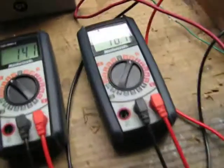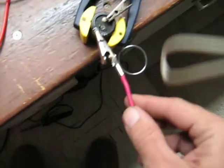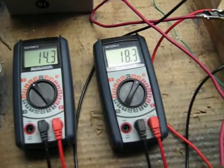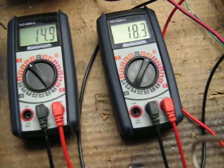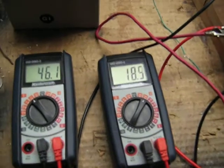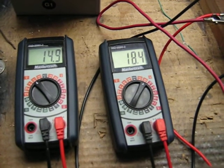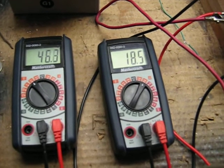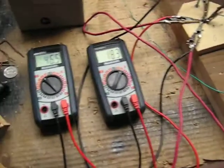What I wanted to show you and ask the Bedinian world if you could answer this for me, because it's kind of perplexing me, is that when I attach this lead to this cap, watch the DC voltage. Now we have her attached and it instantly jumps up to like 46 volts. The AC side stays the same. I'm going to take it off — instantly back down to 14. Back on, back up to 46. And the speed of the wheel doesn't change when I do that — I've tested it.